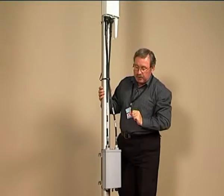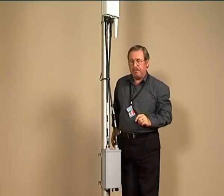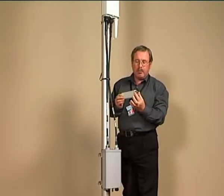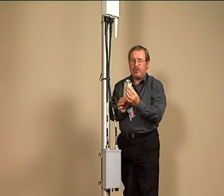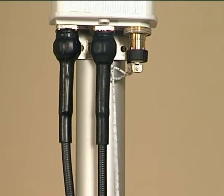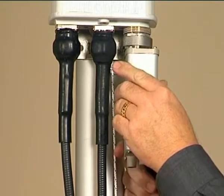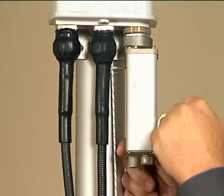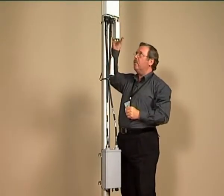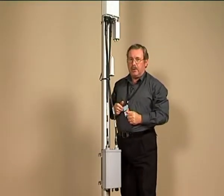The next thing we must also connect is the remote electrical tilt unit. The mechanical connection is to the right of centre, and that is the way we position it over the RET socket. Remove the protective cap and insert the mechanics into the RET. Okay, so we just lift the ferrule and rotate it until it grips the tilt unit.